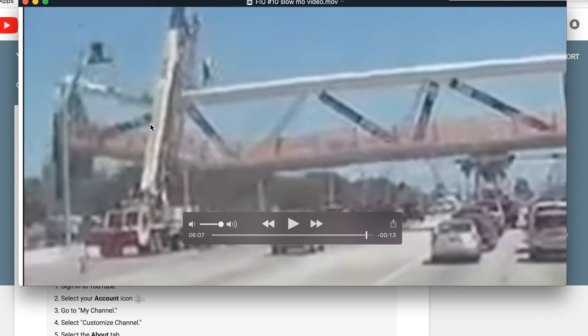As this falls, the canopy comes down, and the bottom deck finally pulls away — obviously still connected with the longitudinal post-tension cables. It pulls it down, and when it pulls away, this is so securely anchored at the number 10/12 connection that the bottom of number 11 stays at that connection. As this comes down, it starts ripping out the post-tension bar inside. When it finally comes to an end, this falls down on top of the bottom deck and in front of this node.